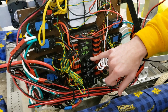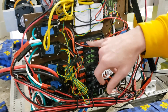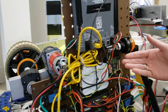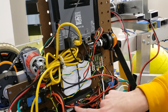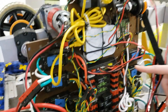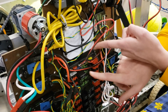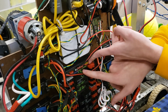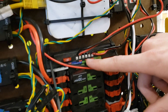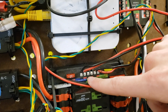It's also recommended that anything lifting the entire robot up is also on a 40-amp fuse. These small pins right here power the smaller components such as the RoboRio and the voltage regulator module. Make sure you have a 10-amp fuse plugged into this slot and a 20-amp fuse plugged into this slot. The RoboRio gets its power from the port labeled RoboRio, and the voltage regulator module plugs into the VRM spot, shown here. If your robot needs a pneumatics control module or PCM, that will also plug into this section of ports right here.